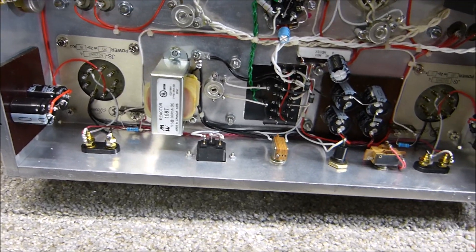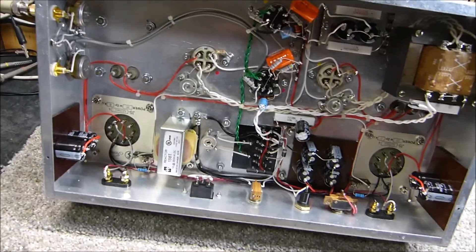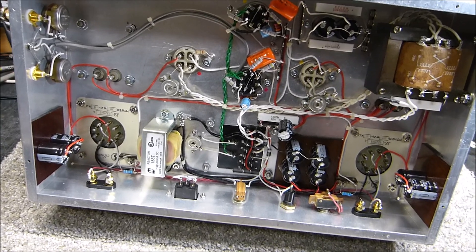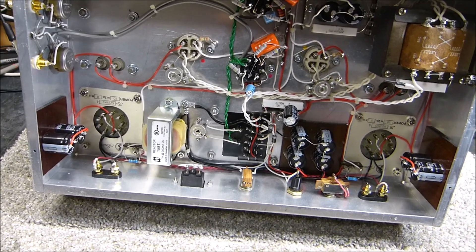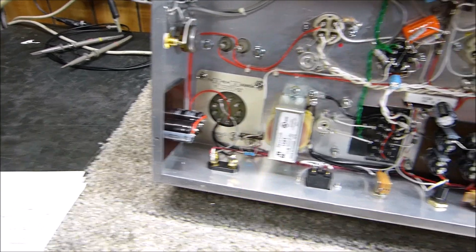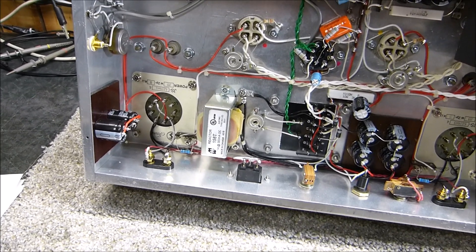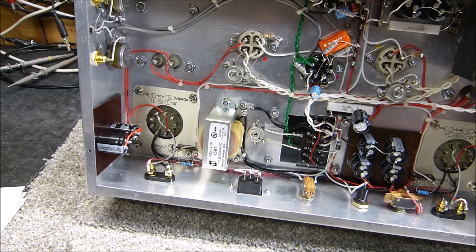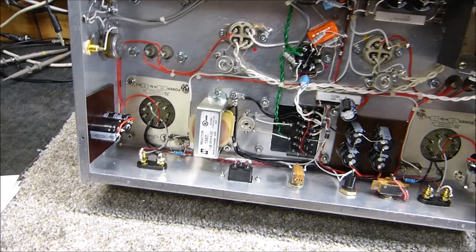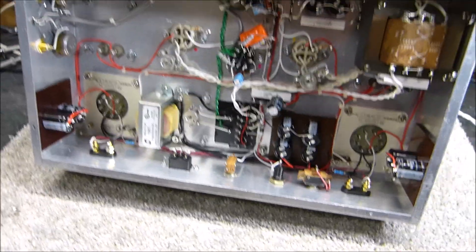In a nutshell, my goal was to use choke loading so I could use a high-end, non-gapped push-pull transformer as the impedance-matching section. If you use a push-pull transformer it doesn't have a gap in the core — it saturates instantly; it just won't work. I tried that a long time ago. So there is no DC flowing through these output transformers.